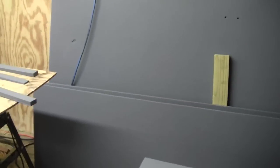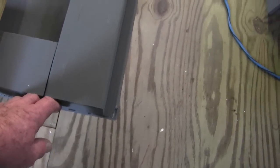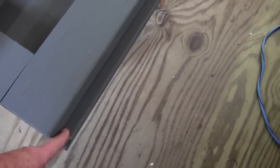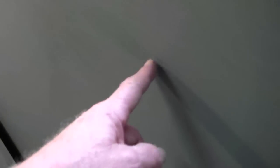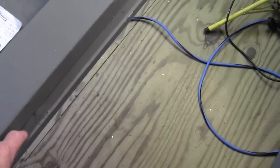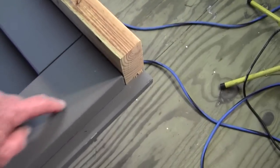Next we can put this thing together. You can see with the old tailgate that it's flush on the top and three quarters all the way around the outside edge. This is the front of the trailer — there's a three-quarter-inch overhang on the box. I have to screw this board in from the other side, drill out the plywood in a pattern, and put screws about an inch back and then every eight inches all the way down — a double row of screws.